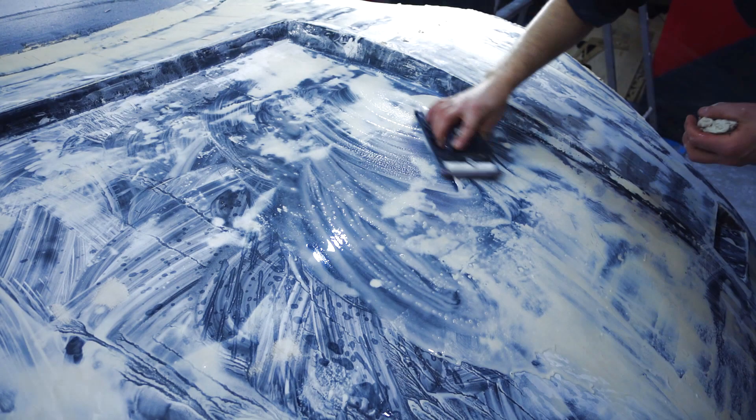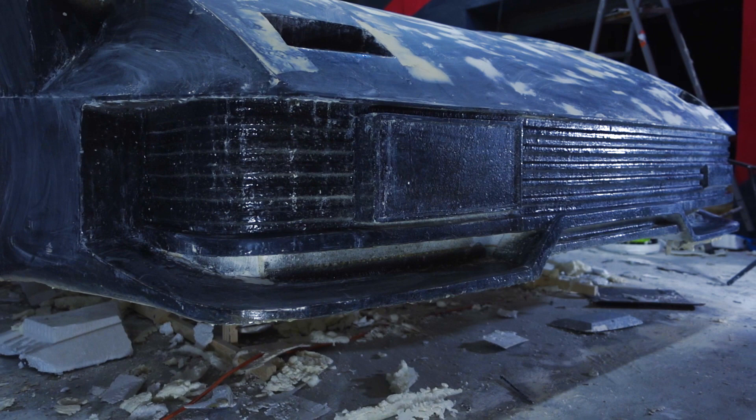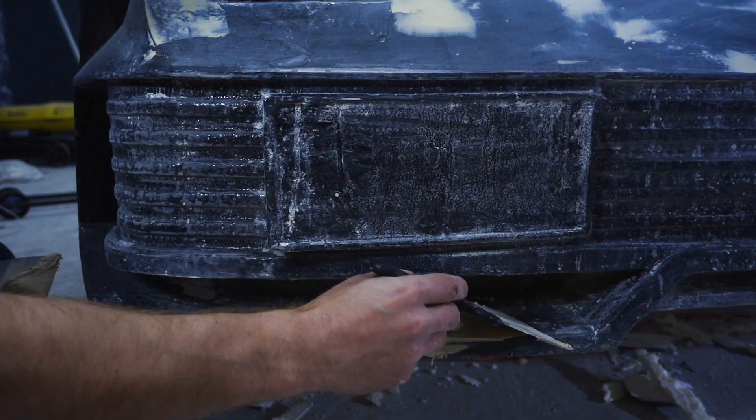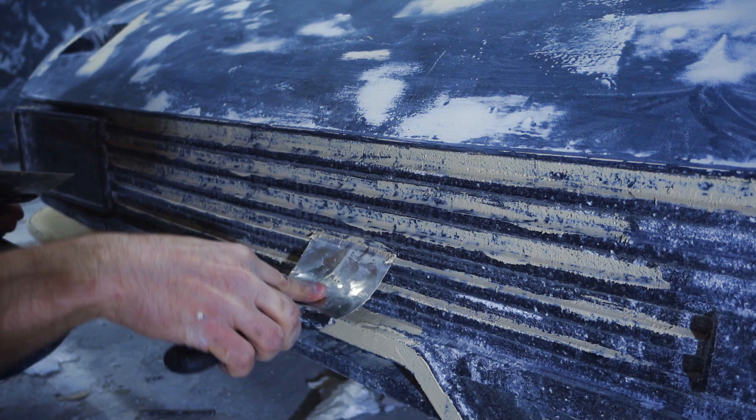Further comes probably the most difficult part of the model — the front bumper, which has enough trouble with its warp stripes. It also depends on its low location, as it won't be possible to just remove it and put it on the table. I started with a coarse rework using an engraver, then prepared the surface with emery paper. I used about 700 grams of putty for the whole front, which significantly saved money compared to using polyester putty immediately without the prepared wall putty.